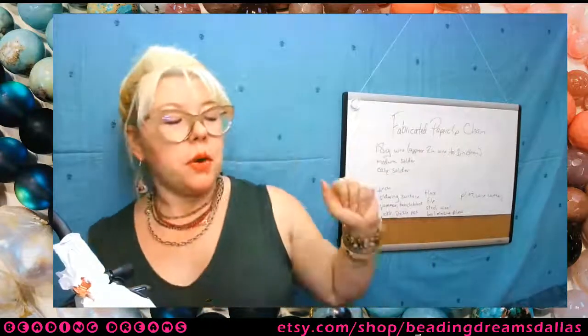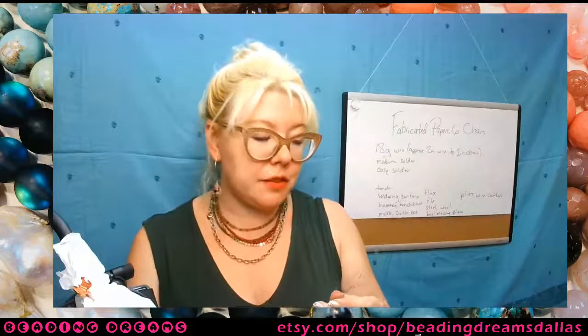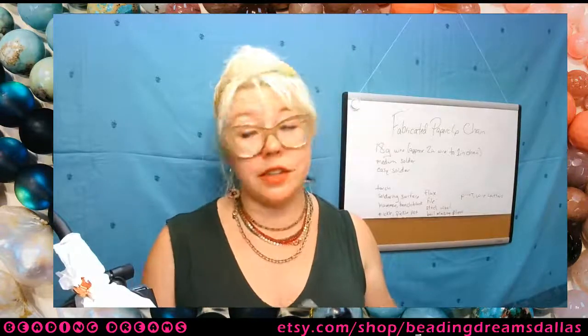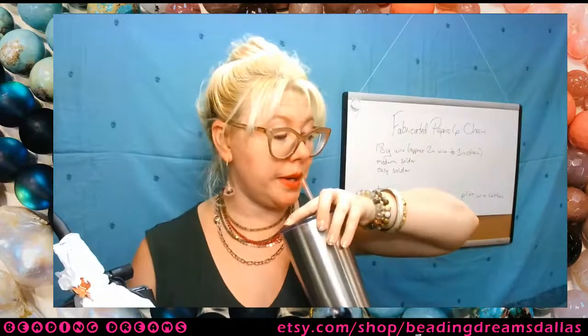Number two, once you've had a torch going in your work area, from that point forward, always assume that everything in your work area is hot enough to burn you, because it probably is. Number three, ventilation is important. If you find yourself coughing, hacking, wheezing, or feeling otherwise uncomfortable in the lung area after you've been soldering, you may want to reconsider your ventilation situation.